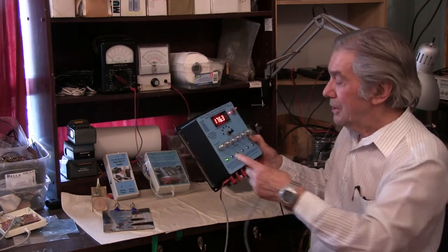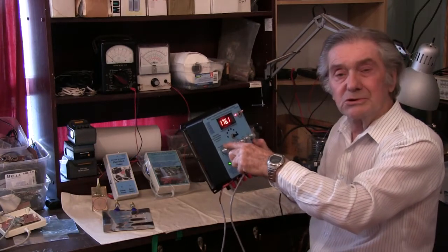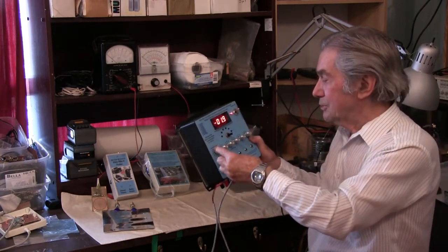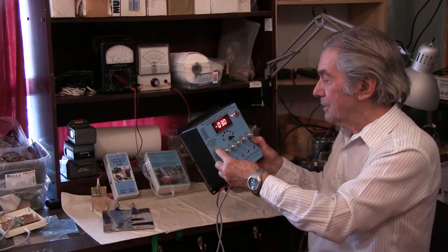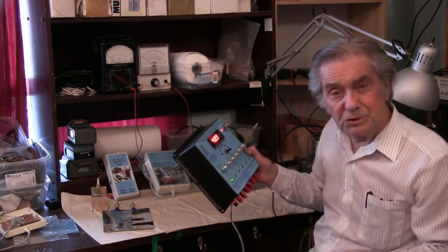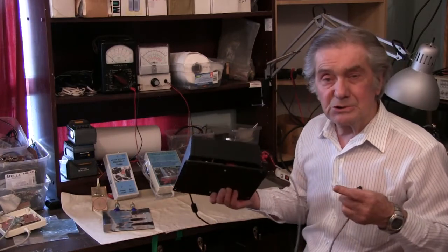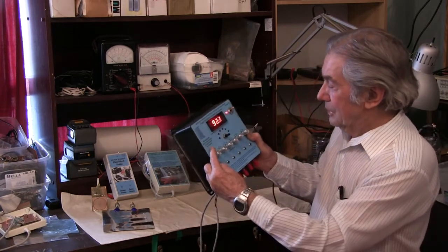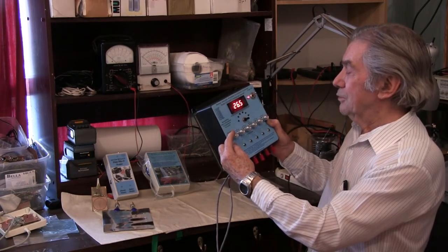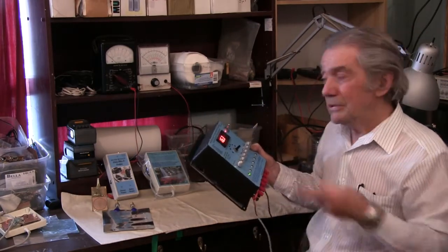The current level can go all the way up to about 1,800 milliamps, which is 1.8 amps. It can go up to 2 amps, but because of the limitation of the 10,000-ohm potentiometer we limit it to 1.7 amps. That also gives us a nice lower range which many customers want — around a few milliamps — because we don't want to overdrive the electrodes. For quality you have to go for the smallest nanoparticle size. Working levels might be 92 milliamps, 66, 27, 26, or 19 milliamps — those are good levels even with these large-area electrodes.